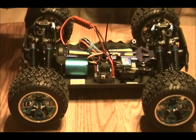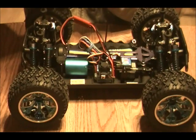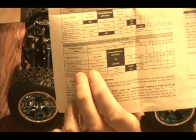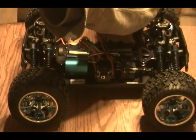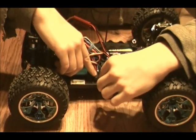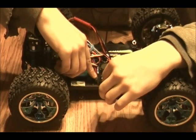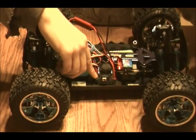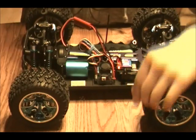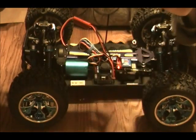I'm going to do an example here. I'm going to set the drag brake force to 10% — that's section two, and it's program value three. So holding down the set button, switch on the ESC. You can see, still holding down the button, it's flashing. Flash once and beep once. There we go — two flashes. And the motor beeps by the way, just in case you can't see the light during the setup.